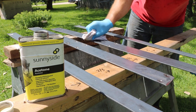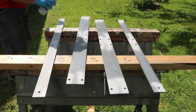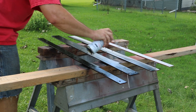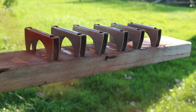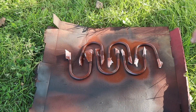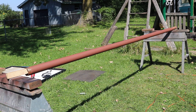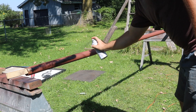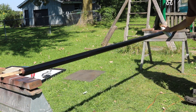The first step for painting was making sure all the metal was clean. After that I applied a coat of primer, followed by a coat of gloss black paint. I also made sure to prime and paint the brackets and the U-bolts. The gas pipe already had a black oxide finish, but I had no idea how that would hold up long term against the weather, so I primed the pipe and then went over it with a coat of paint as well.